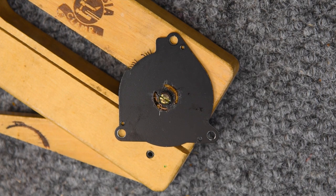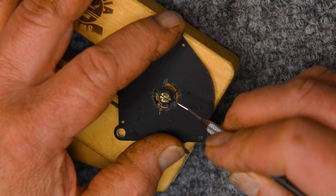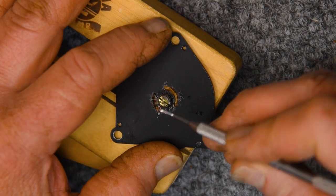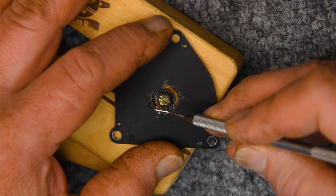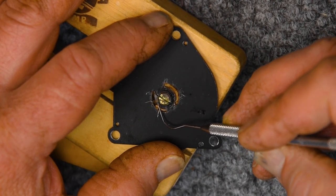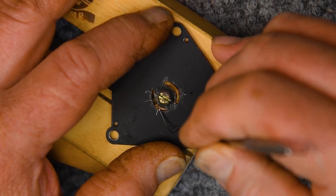Now you can get a little bit better sense of what I saw up close. All the leads have been kinked. Probably pulled too tight. This is soft copper and it can take a lot of gradual bending, a lot of large radii, but it can't take being kinked. Think of a tube. You get to a certain point and it kinks, and yeah, you can bend it back, but it's still going to cause problems.